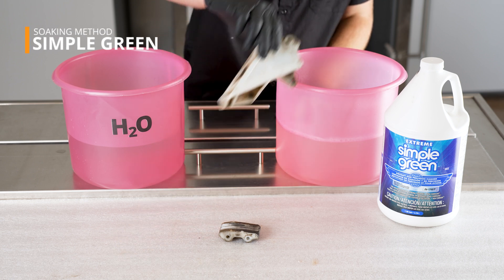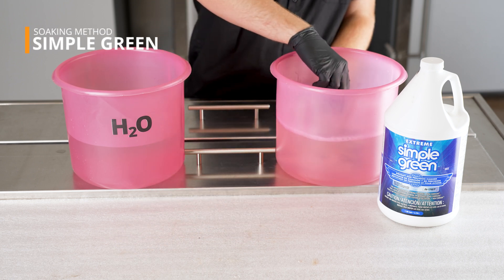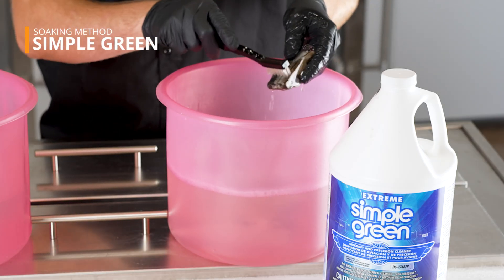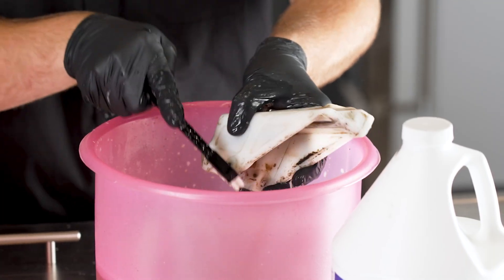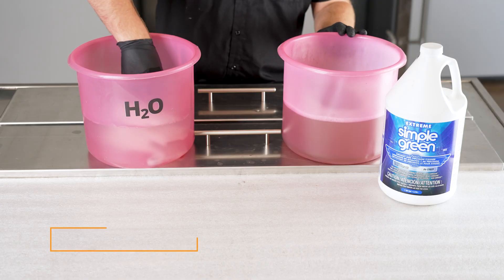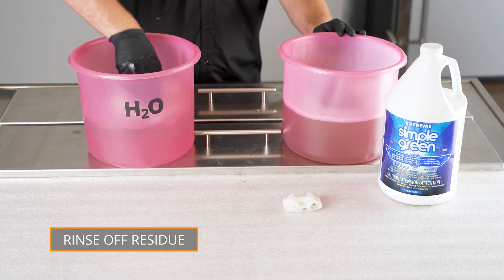Polymers with an accumulation of grease and residue may be soaked in a water-based cleaner. Depending on how much debris is present, a shorter or longer soak may be required. Using a nylon brush is a good way to remove built-up grease and residue in corners and hard-to-reach areas. We recommend soaking the part and brushing until no residue is left. Water-based cleaners will often leave a residue on the surface that must be rinsed off with water before coating the parts.